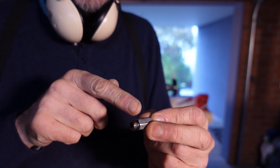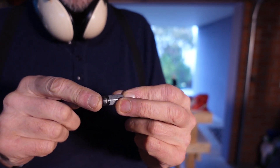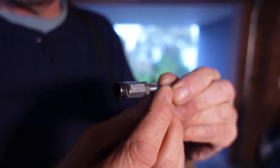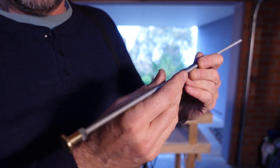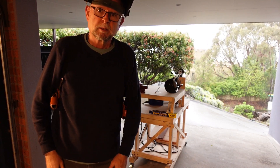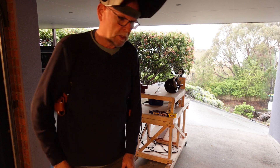I'm going to cut a notch in between the coupler nut and the head of the cap head bolt to hold a bead of weld to weld the two together. And I'm going to put another bead of weld right there to join the torque nut to the threaded rod. It's going to be pretty obvious I'm not an experienced welder, but I do know one thing — we're welding steel that has zinc on the outside, and zinc is a very bad thing to breathe. So I'm doing it outside, there's a bit of a breeze, and I'm only placing two beads.